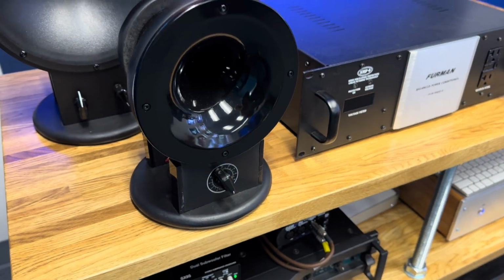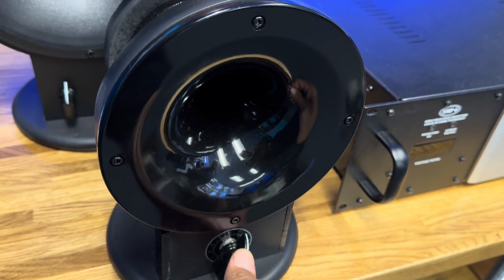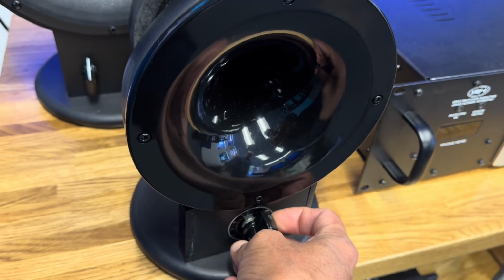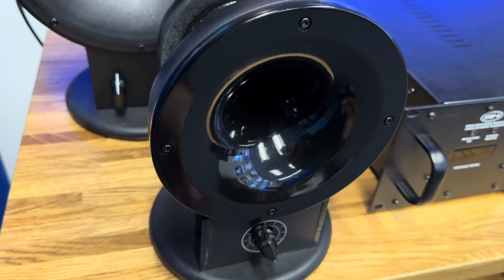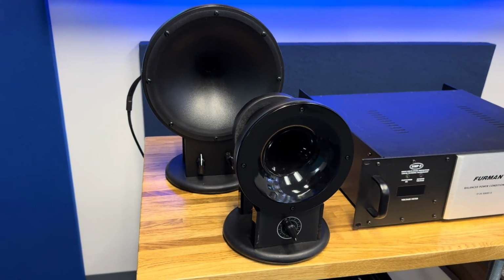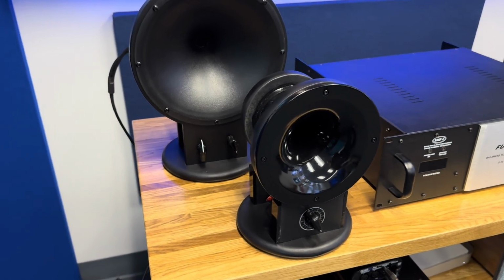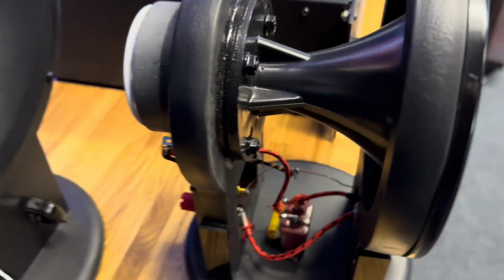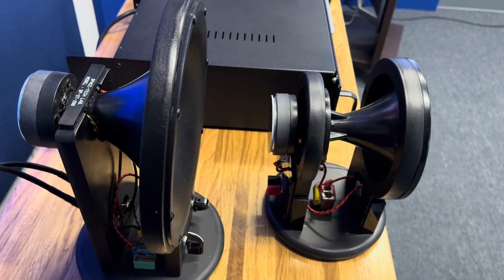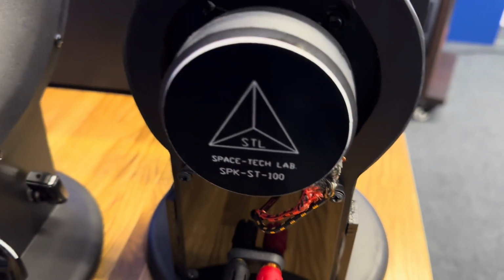It's fun. Now, I know some of you are probably asking yourselves, how do they compare to the Shinjitsu Horn 2+2, the one that I'm using on the Eclipse Heresy project that I've been working on that you guys have seen in those various videos? Well, it's actually like comparing apples and oranges. They're just completely different situations here. Because you have to remember that these horns are designed anywhere from 3,000 hertz on up with the 10-inch, and 5,000, I think, on up with the 7-inch horn. So the frequency range isn't the same, and it's a different situation as far as the sensitivity is concerned.